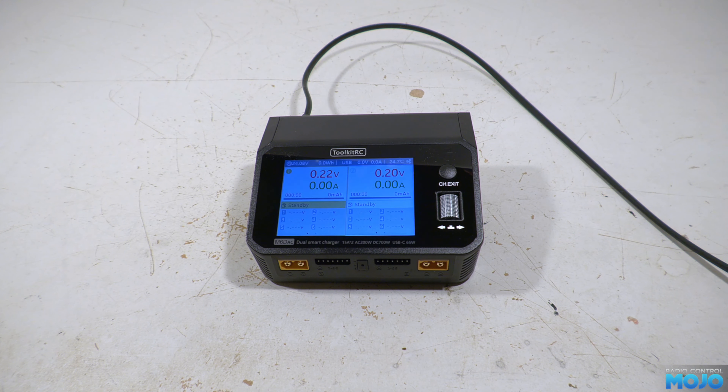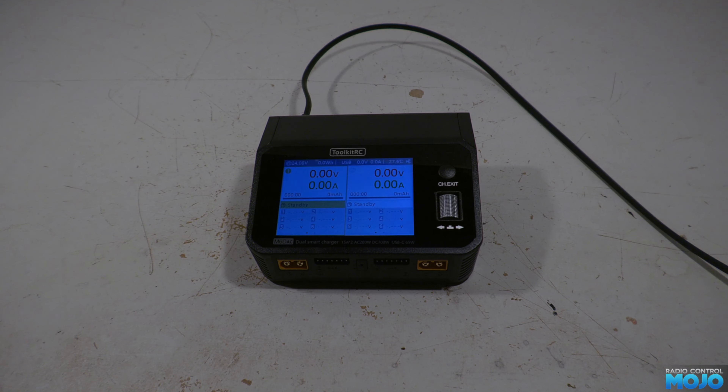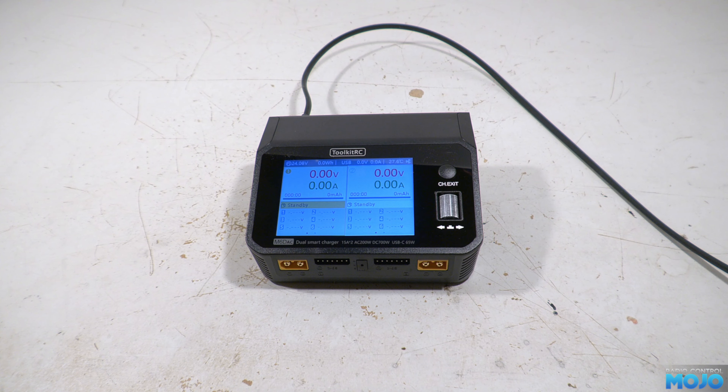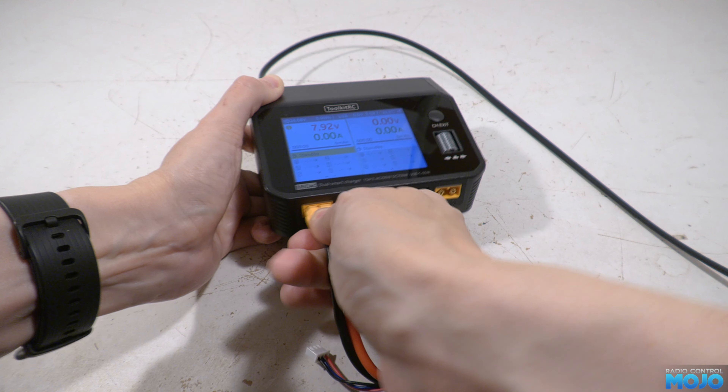With the charger connected and powered on, we get a nice beep and a splash screen quickly followed by the main info screen — all nice and quick. The screen does appear to be flickering, but it's one of those times where in person it looks just fine; the camera beats with the backlight. I tried switching from 50 to 60 frames per second but that didn't help, so I ended up using a very slow shutter speed. In hindsight I should have turned the brightness to maximum as the backlight would likely have a 100% duty cycle with no flicker.